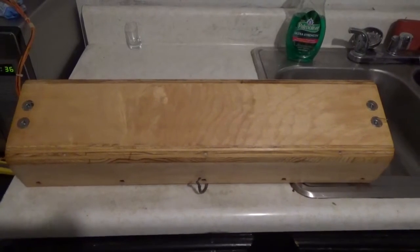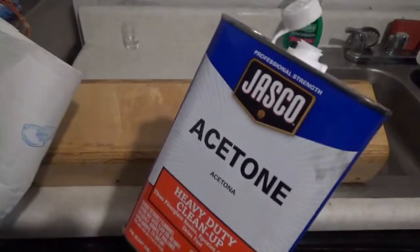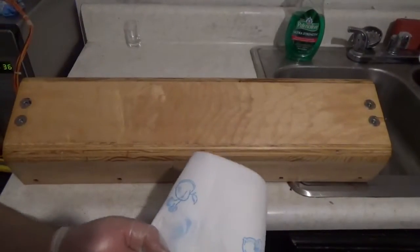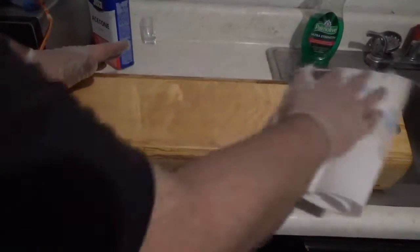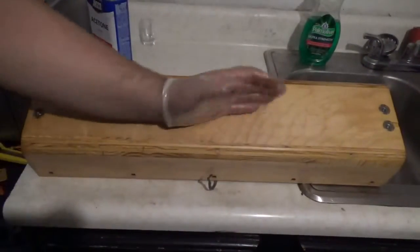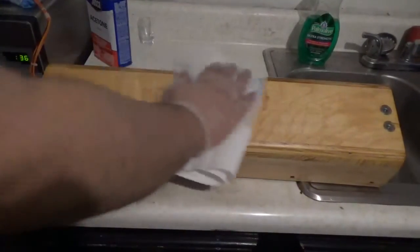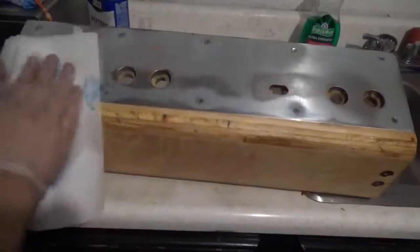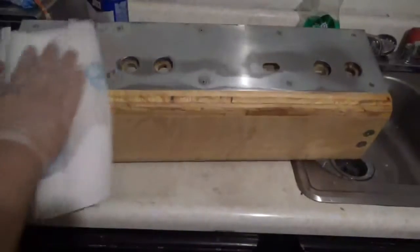Okay, all the goop is gone. But I'm still going to wipe it down with some acetone. The reason why is because acetone evaporates quickly and it'll make the xylene dry very quickly. I don't want to put an overlay over an oily piece of wood. So acetone is going on. That's literally dry right now. This will also help clear up any remaining boogers. Looking beautiful, though.